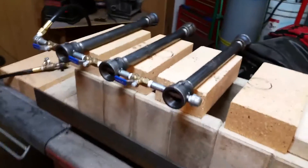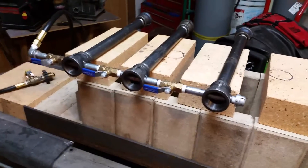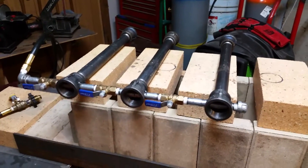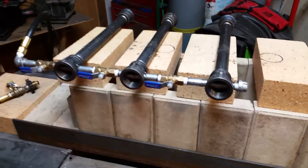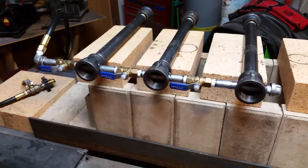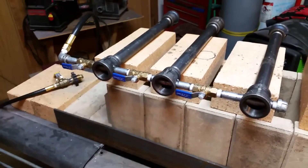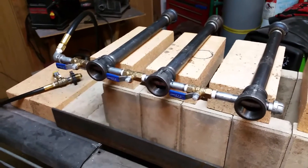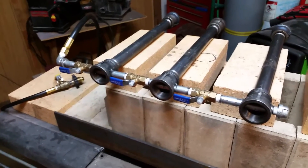After testing those burners, I wanted to give you guys an update on some of the changes that I've made and some of the modifications that I still need to make. I changed my MIG tips inside from the 0.035 to the 0.023. The reason I did that was because running three burners on a 20-pound propane tank, there just wasn't enough of a torch effect — it had flame, but there was no pressure behind it.